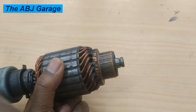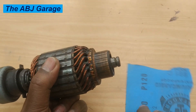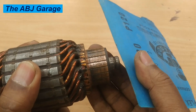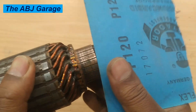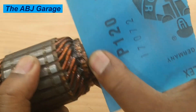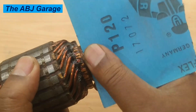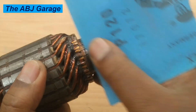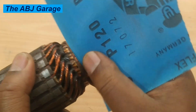In order to have a good resistance reading, it is best to have the commutator surface smooth. That can be done by simply sanding it with a fine-grit sandpaper of this kind, removing residues from the surface. By sanding it you can improve the resistance reading — this will remove any debris or foreign material that may interfere with accurate measurements.